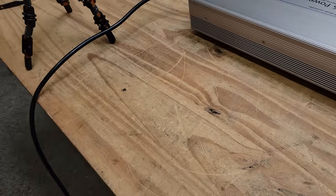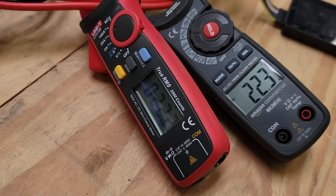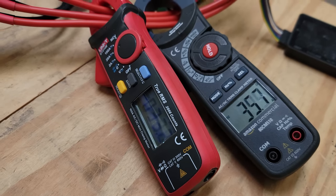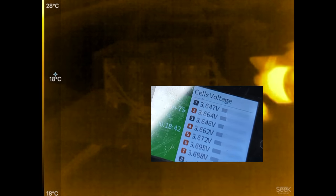We're going to turn on the heater and see how much current it draws. The two meters match — reading 22, 28, 30, 31. This one only goes up to 100 amps, that's why I'm using this one, but this one's higher quality. So we are loading this battery with 80 amps. The cells are sagging a bit, not that much. We'll see how this module does.